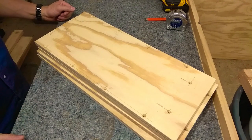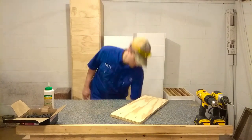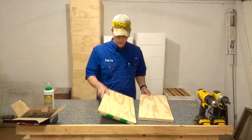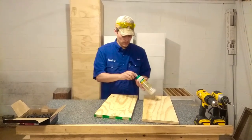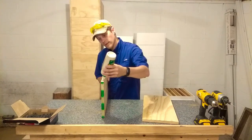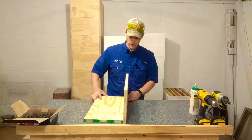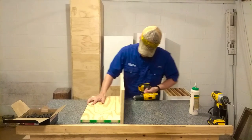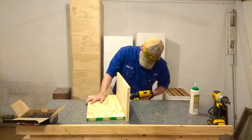There are all the pre-drills. Let's get this thing assembled. We're going to start with the bottom board and one side — make sure your countersink holes are facing out. Put the sideboard facing down to start with the bottom board. Don't forget to put some wood glue on all the edges. Double-check alignment and then put the screw in.